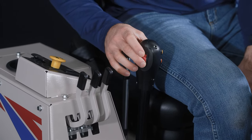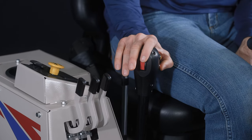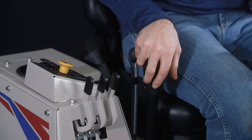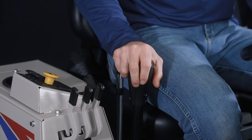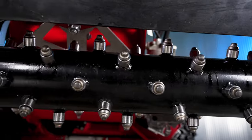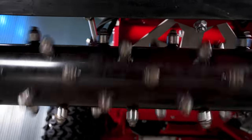This red switch changes from one circuit to another with the 12 volt. These buttons, the orange and yellow, are for 12 volt actuators. So like on a snow blower chute where you're controlling the pitch of the snow blower, or like on this power rake, actually, there's an actuator for controlling the hydraulic speed of the drum. That's gonna be done using these buttons. And you'll notice that those are used in anything that has a variable hydraulic application.